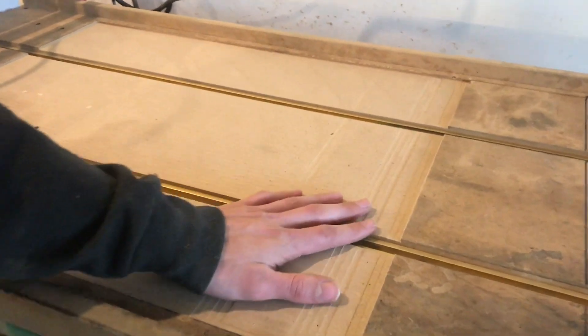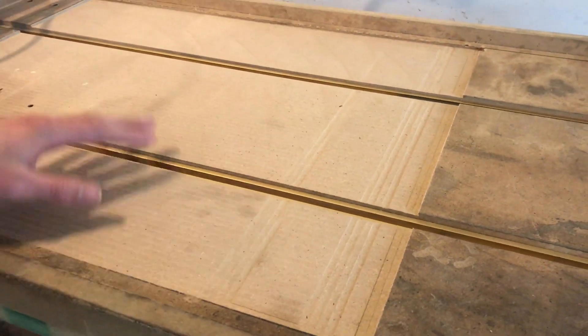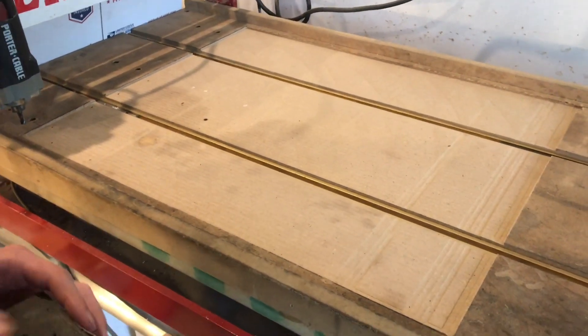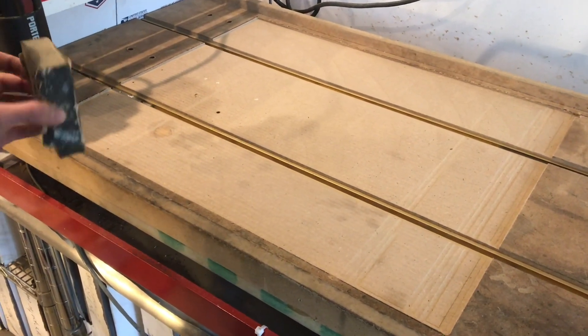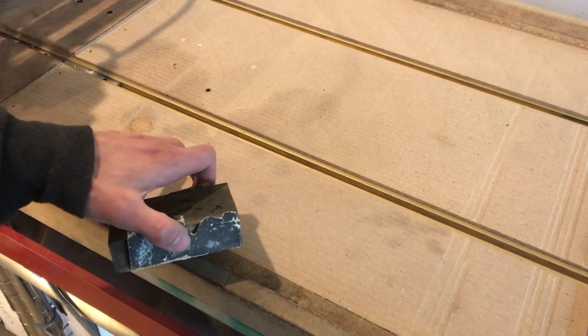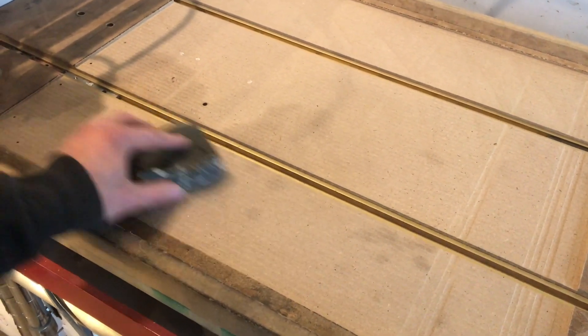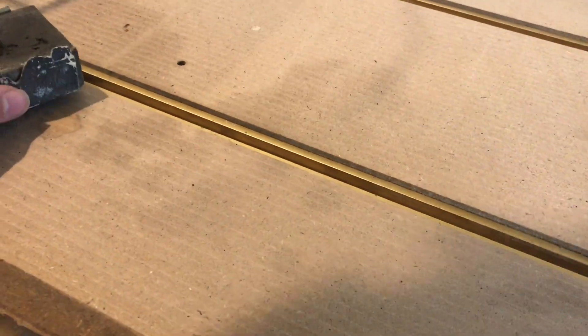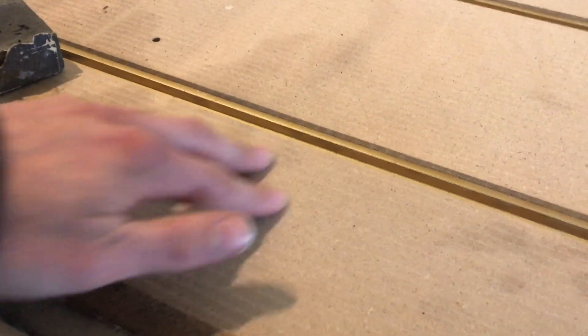But I don't have that much table left and I rarely use this portion anyway. If I do, I'll probably be laying a flat sheet over everything, so I think that'll work out. After the finish pass, there were still some ridges and scrap material, so I just took sandpaper and that stuff comes right off. You can still feel the lines a little bit, but they're very minor — probably only one or two thousandths of an inch.